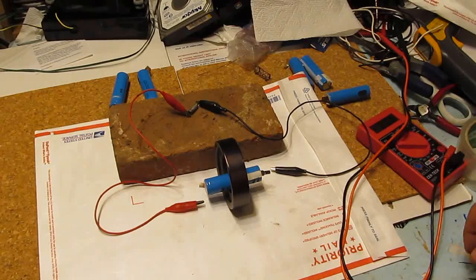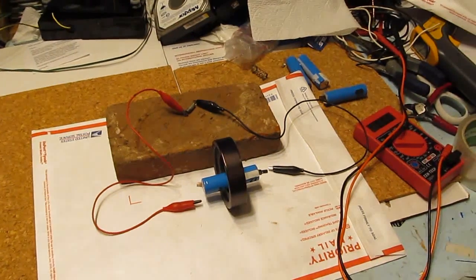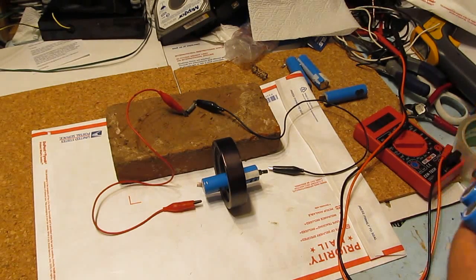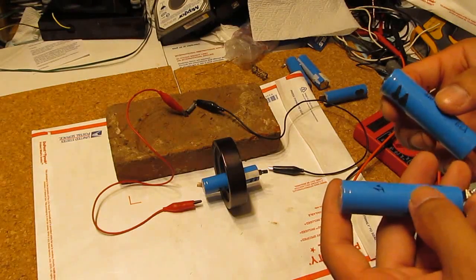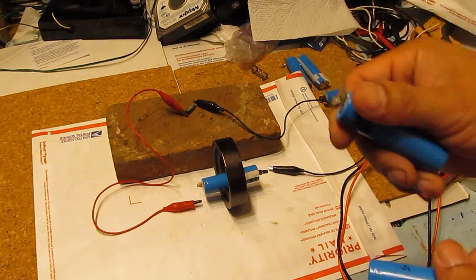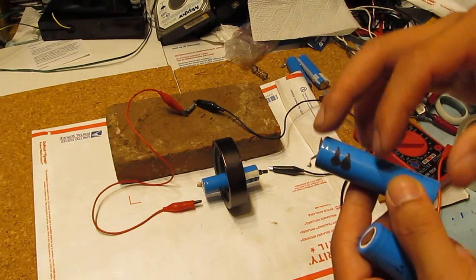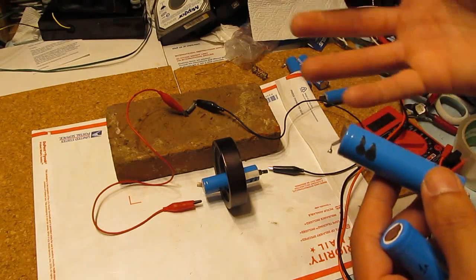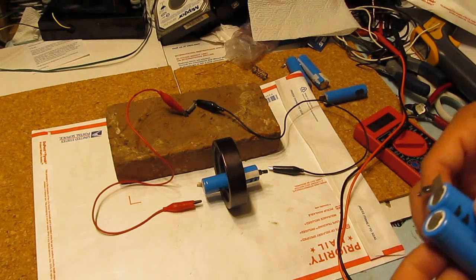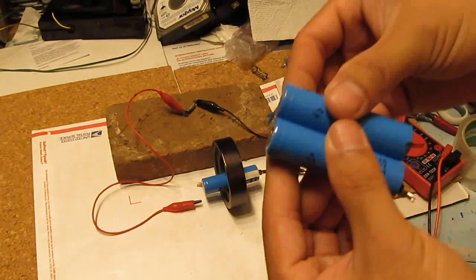After charging these batteries, they all charged fine and none of them heated up. So I have to find the bad cell the hard way. When a battery heats up during charging, it has become very resistive — it heats up internally and doesn't take a charge. But in this case, none of them heated up. So the next step is to cut them into individual cells and do a load test.